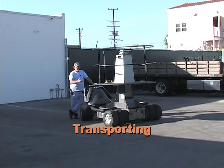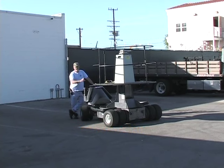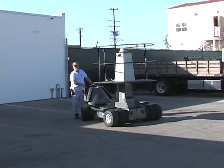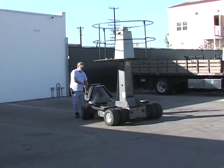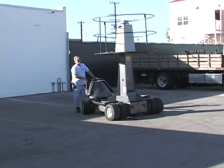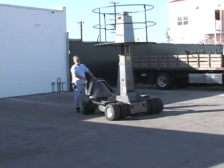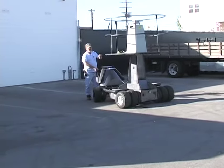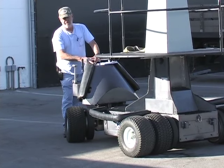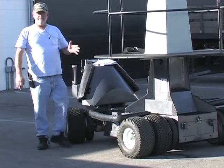For transporting this crane — when you load it up on a truck or trailer to bring it from place to place — you get it up on the truck. You want to use ramps, and if you use ramps you need to use a winch. You can control the movement up or down, make it safe. You can put it in position, lock the ratchet brake, get it tied down with the chassis, then release the brake. Next, take this arm — turn the pump off, run the arm up and down until it runs out of pressure. I usually get two to three strokes. Now it quit going up — now I release it and bring it all the way down so when it's riding in the trailer it's not on the hydraulic cylinder. Next, make sure the power system's off, the drive — both switches — and make sure the pump switch is off. Now you're safe to drive.